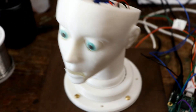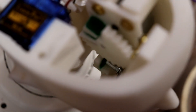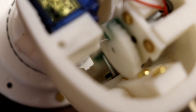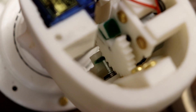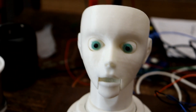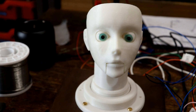I decided that's just too complicated. What I ended up doing is — the end of the solenoid used to just push against the plastic, which could make a noise as well. One piece of felt just stuck in there, which was quite challenging to do working around all these other bits. But that's perfect — it's just taken it down enough and made it even quieter. If it's still opening too much, you could add another bit of felt.